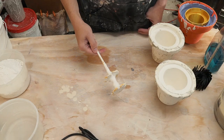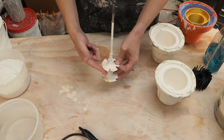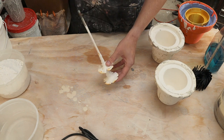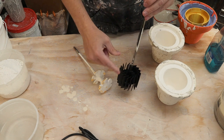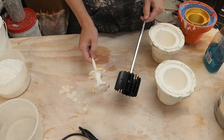Next up is actually mixing the plaster. I've been using this drill attachment — it has fan-like blades and at this point it has all sorts of plaster caked on it. The way these blades are designed, they push the liquid up or down depending on direction, and in normal operation it actually sucks air down into the plaster — I think this is the wrong thing to do. A lot of people advocate mixing plaster by hand, which would minimize bubbles since you'd be very gentle. However, reading the data sheet for the plaster, it looks like you want to agitate it quite a bit to make it stronger. There's a tension between weak bubble-free plaster and stronger plaster that requires more mixing. I found a different fan-type mixer that slings plaster out to the sides of the bucket instead of pulling air down — I want to give that a shot.